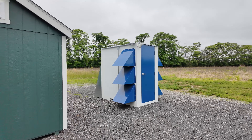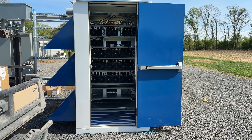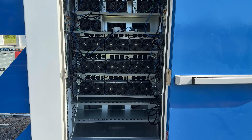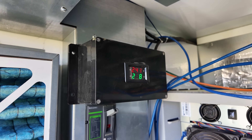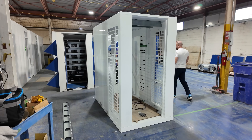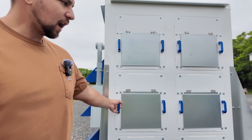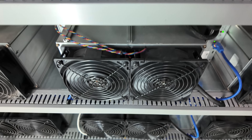Let's start with the Digital Shovel Nanopod. This is one of the newest products out here — a Mini Smart Mining Farm. Looking at the sizing, it's enough to basically just walk right into the door. It can come with security cameras. It has six exhaust fans on the back and I cut in a little meter to monitor the electricity in real time, but you can also do that from the software. It's had a lot of iterations in their very long testing period, so things like handles have been added to make servicing exhaust fans easier. Depending on the configuration, you can deploy 27 full-size miners in there, at least with the S21s.